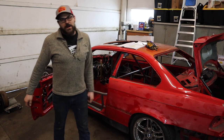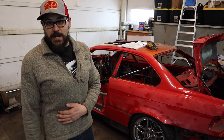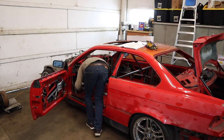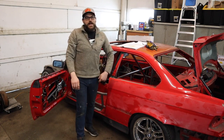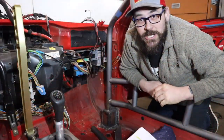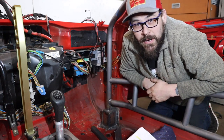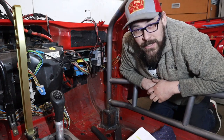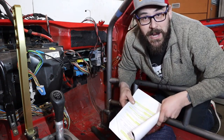I don't know where I want to start. I think I'm going to do the anti-wheel intrusion bars because they're going to be a challenge. I should have done them before I put this door bar in because now I'm going to have to get way down in there. I'm contemplating taking the pedal assembly out just so I can weld down there easier. Anyway, let's get to work. I should have done the anti-wheel intrusion bars before I put in the door bars, but I really wanted to build the door bars, so I did.